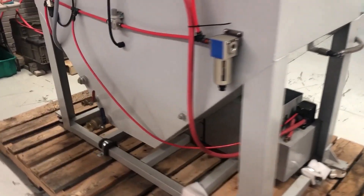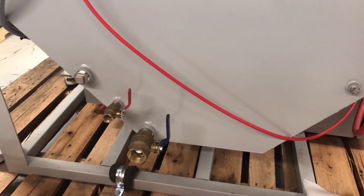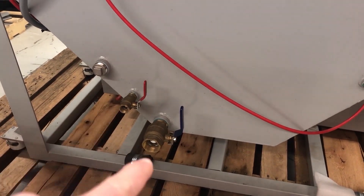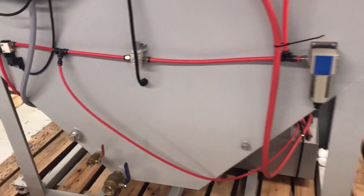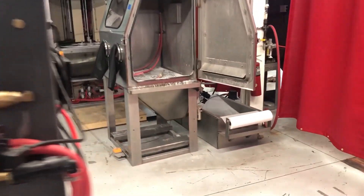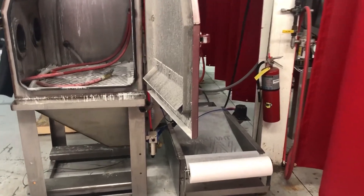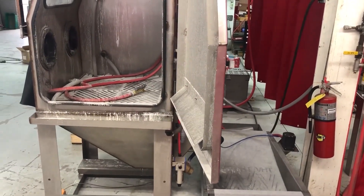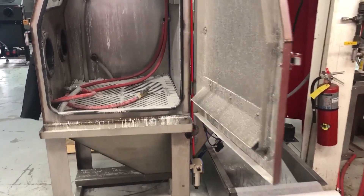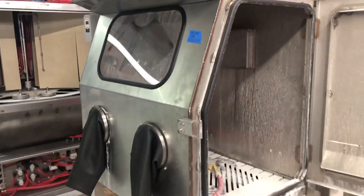On the 3500, you can see the water drain-off valve on the back — right there is the main drain. You can drain the water off these machines and then just refill them with fresh water. Leave the abrasive in them, just drain the water off. You can also put the antifungal or antimicrobial in the cabinet — it's not going to hurt, but again, it's not the complete solution for keeping it from stinking.